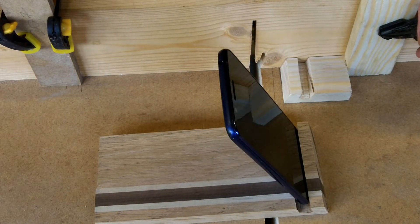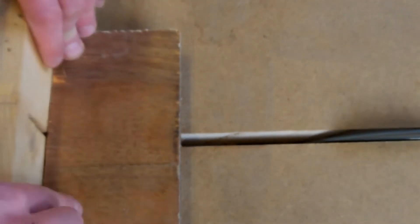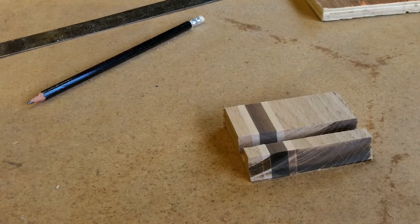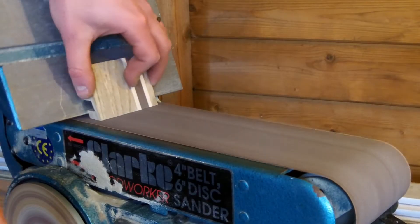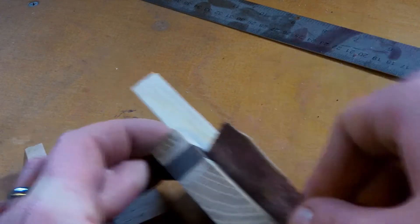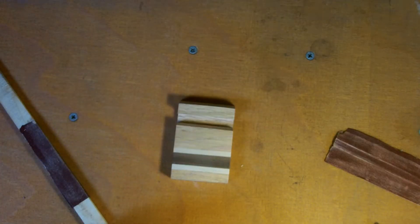The test fit's looking good. One last straight cut and that's the first one done. I got two more pieces from that one glue up, including one at a different orientation. Then I cleaned up the front edges on the belt sander and cleaned up the slots with a sanding stick. All that was left was to give them a coat of boiled linseed oil.